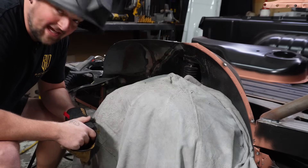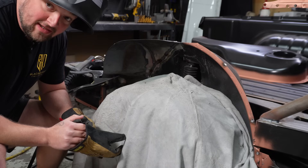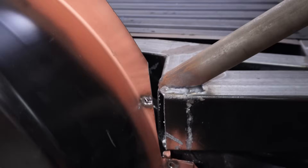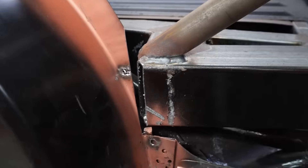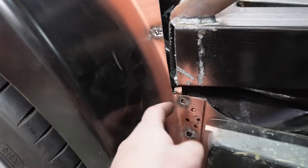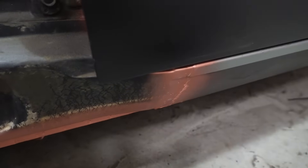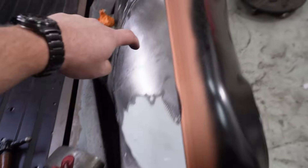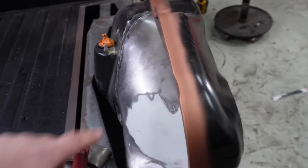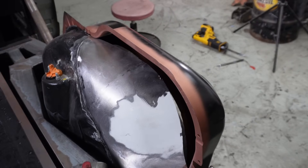It's the next morning — it's actually Anzac Day, so hopefully everyone does their minute of silence. I will be at 11-11, but we need to get this thing welded on. That wheel arch is just sitting there. I have cut the corner off of the big frame, and I'm probably going to need to plate that up just to close that up, but I think it was stopping the outer wheel arch from being forward enough, which was then causing that gapping issue on the rear quarter. I think the next step is marking out this straight line of where the outer wheel arch is compared to the rear panel that we've just made, because I've got a lot of overhang that we need to either try to manipulate up or just cut off.